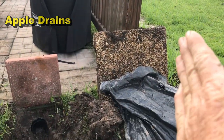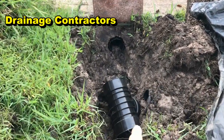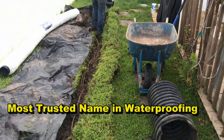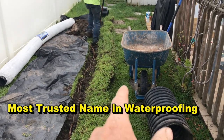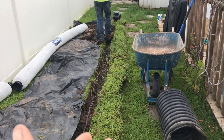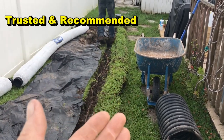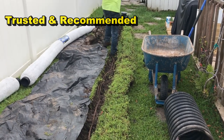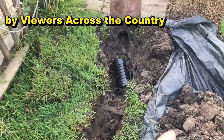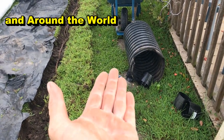Along this side we've got the easy flow — the French drain that runs over to a sump pump. What we're doing is adding a little bit more. You can see I put a T down there, dug that up. We're going to come right down through here. Chance pulled off the sod — you can see the cable wires down there, not a problem. We're basically going to run about 25 feet of easy flow with a couple of catch basins. Real simple: take off your sod, put it on one side, lay out your plastic, put your dirt on the other. Dig backwards as you dig through your trench — this trench will be dug in 10 minutes.